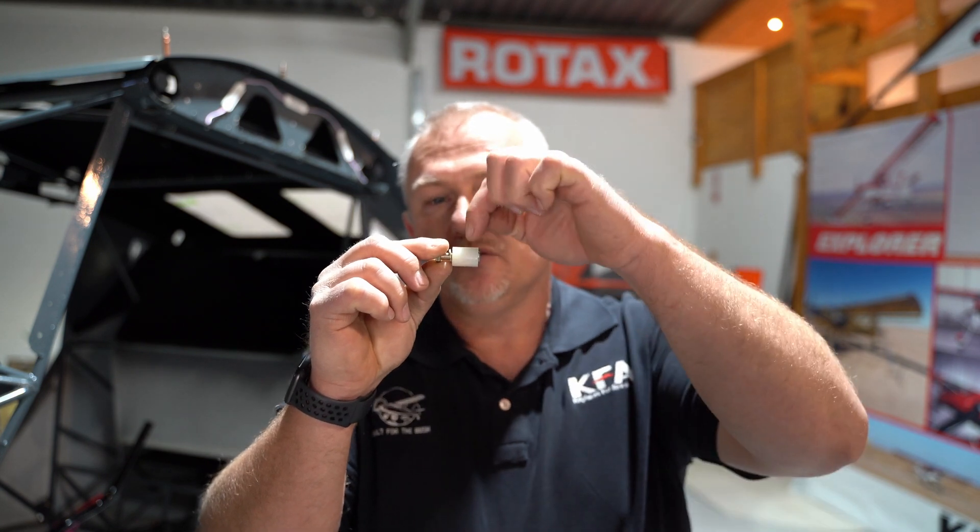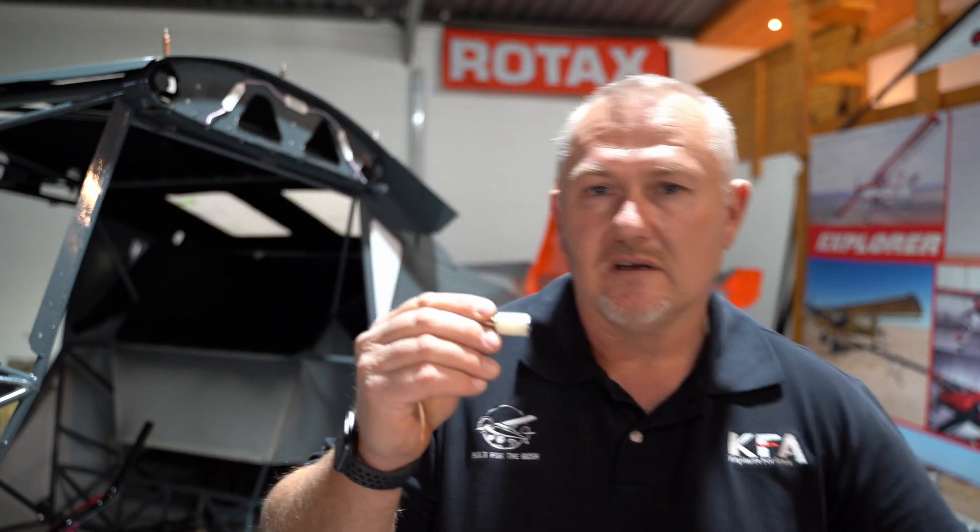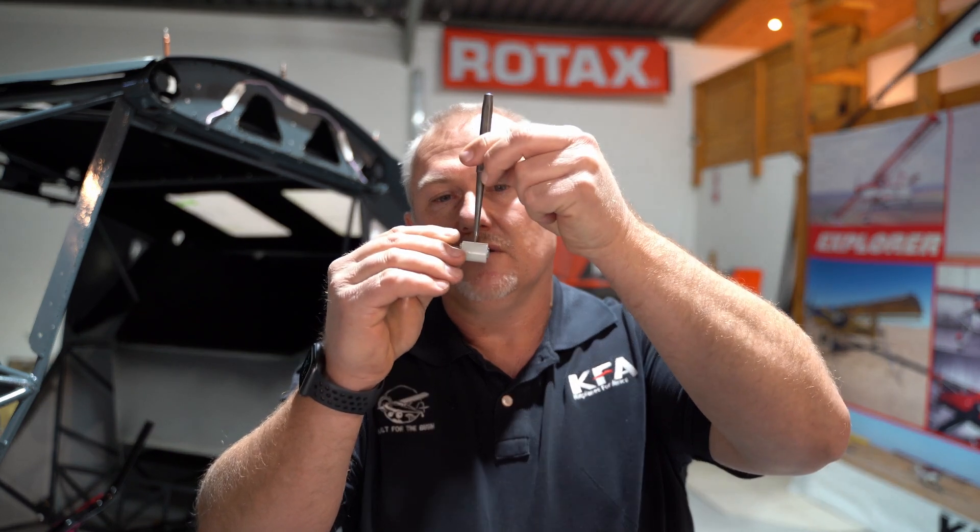There are a couple of tricks. The first one is to drill two holes on top of each of the rudder pedals on the tube. These holes will be used for two things: the first is to hold the nylon bush — you need to install this little nylon bush into that hole and hold it in place while tightening the bolt, using a pin. The second function of that hole will be to lubricate the nylon bushes over time, so it's a dual function.